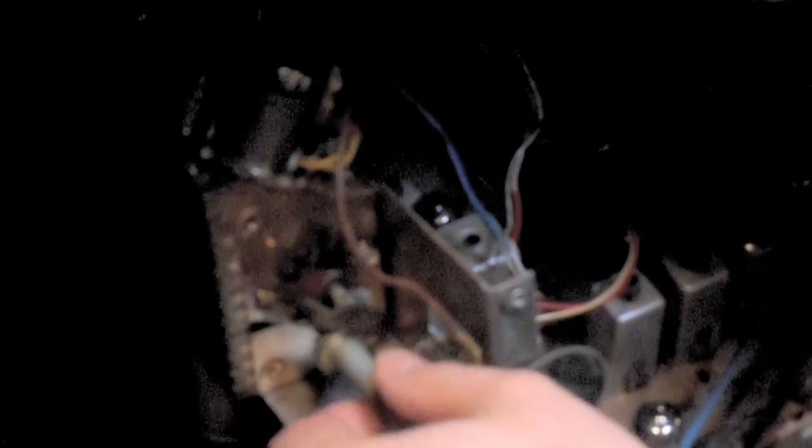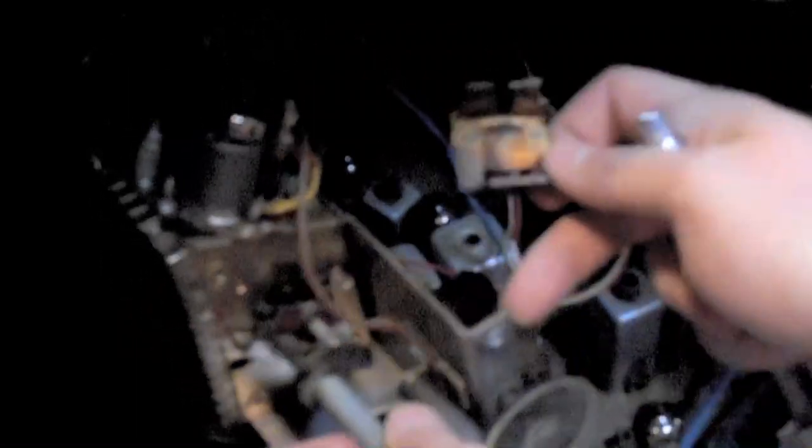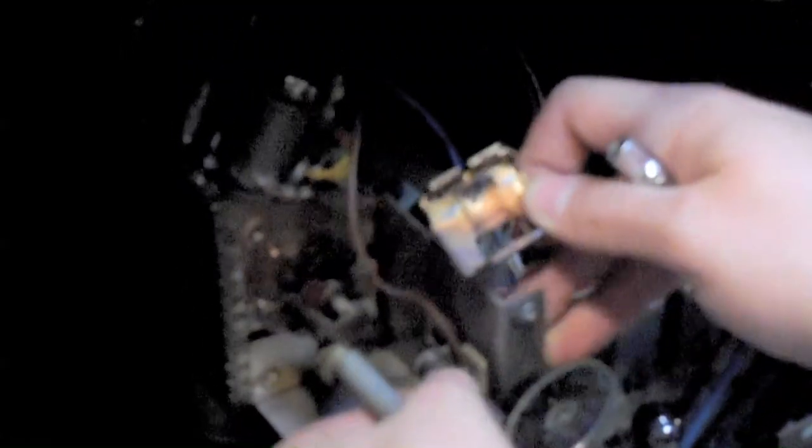That's lovely. Okay, it feels like I have actual fine-tuning action. That's nice. The dial light is underneath this little metal sleeve. You're supposed to push it backwards and slide it off, but it wasn't cooperating, so I just bent it down slightly, slid the sleeve off, and swapped the little bayonet base bulb.